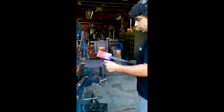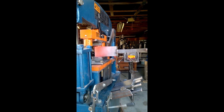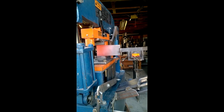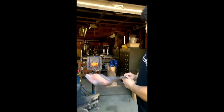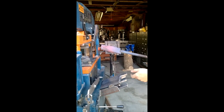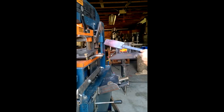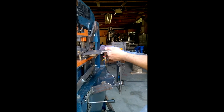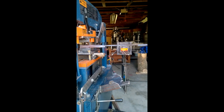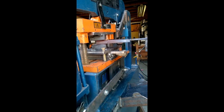So here's a situation where using these spacers, I think, would come in handy. Whoa — look at that! It did curve it. So this is where the spacer's going to come in handy. I'll throw that in there — I know I'm wasting time doing this and the work is getting cold, but it's still faster than working with a striker. I still have some heat in there, so let's take that out.